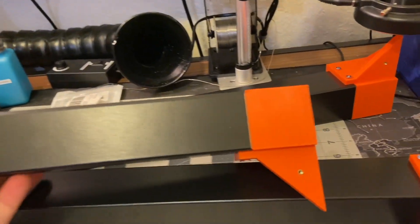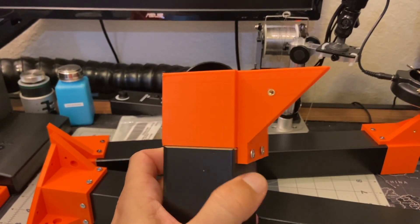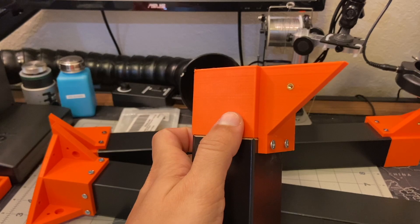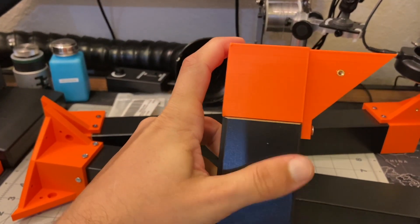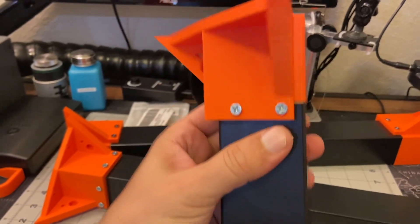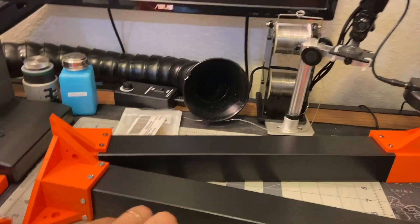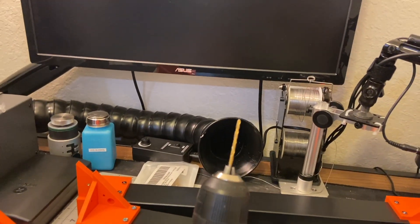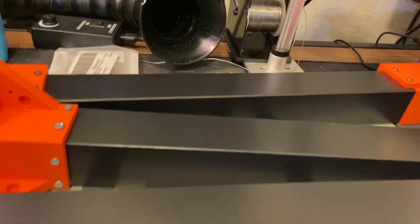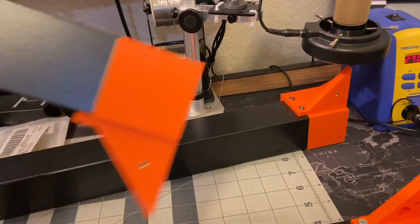One more thing about that specific side where the bottom of the feet are — they use harder wood and we were screwing too close to the edge. When you screw too close to the edge, the wood pops out, which makes the part not seat flat. What I recommend is drilling holes first: place the part, mark the hole, then drill — that way you remove the excess wood. Even a very small drill, just a few millimeters, helps a lot. It also keeps screws from going upward or downward. That's one of the things I learned assembling this.